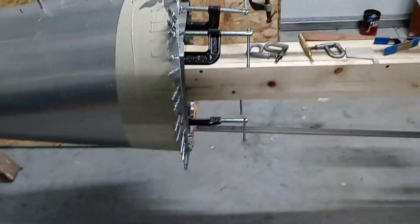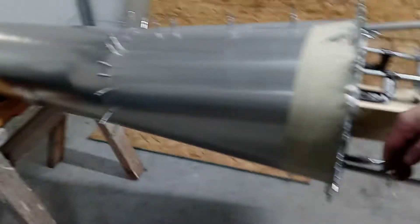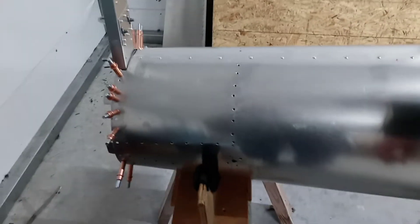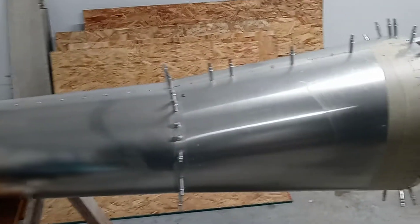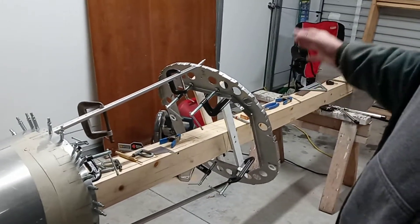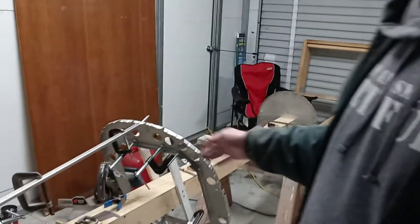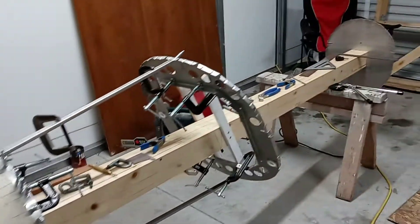You've got to take it apart to deburr it, and he will have to do that too. I've still got to put the ETs and the doublers on there, and he has already had the E2 in there. I was thinking about putting it in there and going ahead and cutting the beam off, but I thought it would be better — it's more work — to go ahead and get all this up to C done, so I get a good straight fuselage. Then once I get all the way up there, I can go ahead and cut the beam off, put E2 in, do all the back, and then start going forward and riveting.